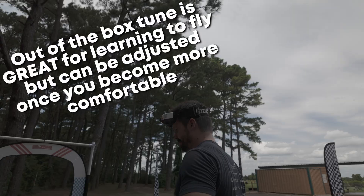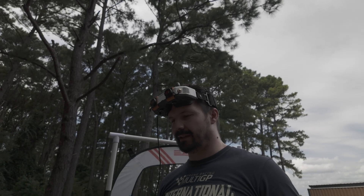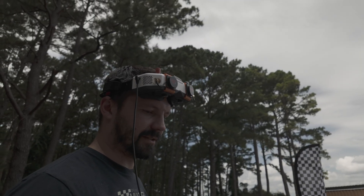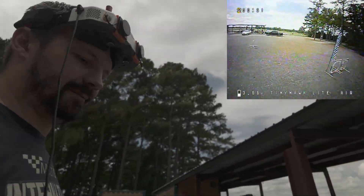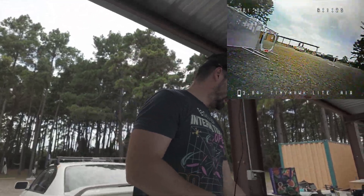So what did you do to fix the tune? I added a little bit of D-term — actually D-term was zero, I don't know if that's correct. I added D-term and cranked up P-term, and now it flies way better. If you start to get a little bit more practice, you can adjust the tune to get a little more control. Previously you couldn't do sharp moves — like if you want to turn, you couldn't do that. It would just sag and go down. Now at least it can do that.